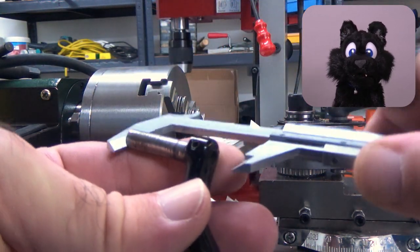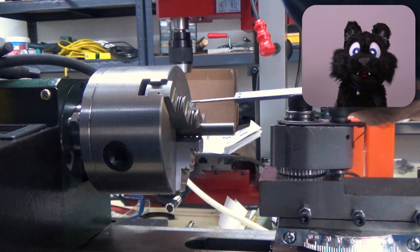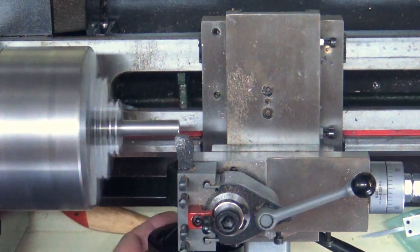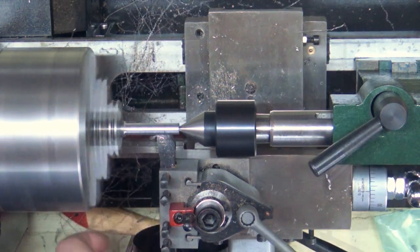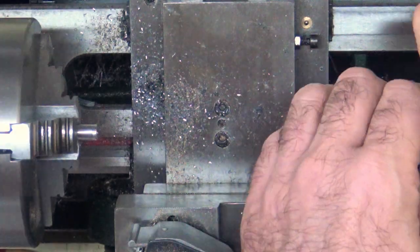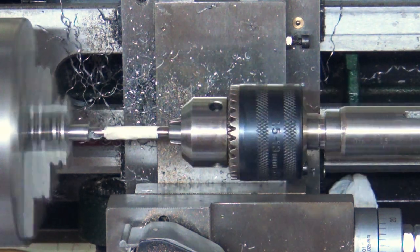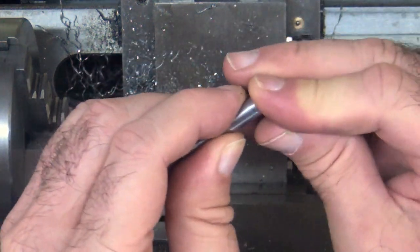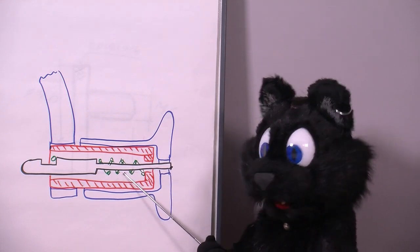Up next, the crank. The plastic handle has worn down the shaft on the inside, so it's quite a bit loose. I decided to remake the metal part of the crank. Lathe time! The replacement is a tube with a narrow end that holds back the spring inside. Simple enough.